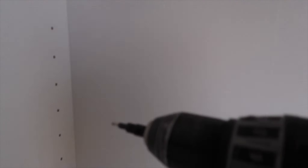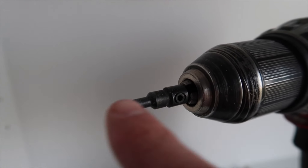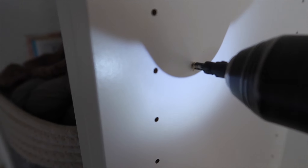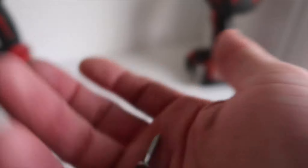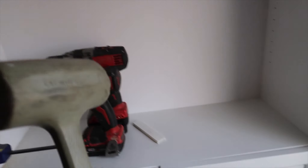Alright, the setup we're using for this - we've got one of these countersinking bits. We've got a little drill bit there, a twist drill, and then this little countersink apparatus. The nice thing is that this slides in and out and you just lock it so you can adjust the depth that you clear out. This is the inner diameter of our screw, so we drill that out and prevent the wood from cracking or breaking. It leaves a nice little countersink there, so when we take our little screw and put it in with a screwdriver, when we're done we'll take a little white filler and fill that in. This sucker is pretty rigid. These are the tools, and then occasionally the old knock-o-meter if we need to make some micro adjustments.